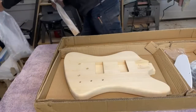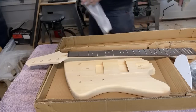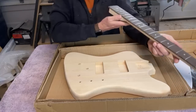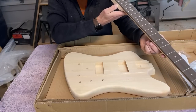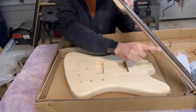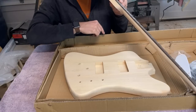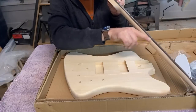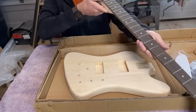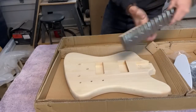The neck is the most important part of the kit — this determines if it's going to be a good, clean instrument or not. Before we even look at the fit, we're going to look down the neck and it looks pretty straight. This edge looks like it might have a little dip right here — actually it just kind of slowly tapers off towards the top. That might be something we can fix with the truss rod adjustment. I won't really know until I put a notch straight edge on it.